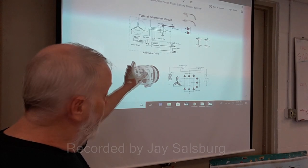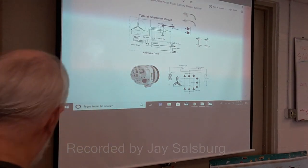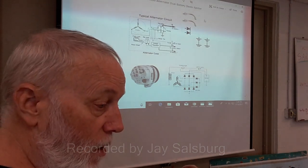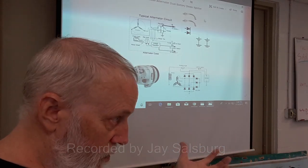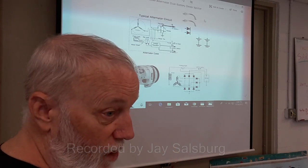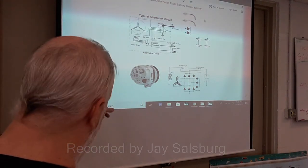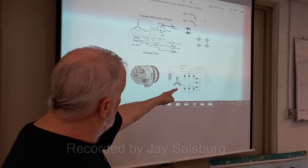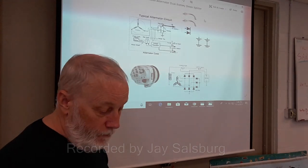So this is probably obsolete, and the diodes, as you can see, you need 100 to 200 amp diodes. So the splitter is a massive heat sink with very large diodes, you know, $200 for a good one. These cheap ones you buy for $34, no. So you see the alternator here, and the schematic of another alternator with the diode splitter and two batteries.